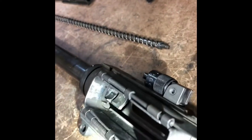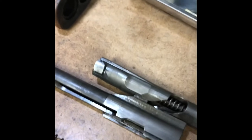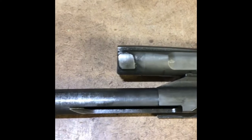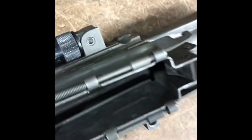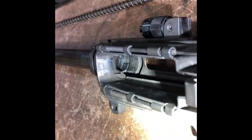Got a flashlight on the inside — there you go. You can see the chamber area and the locking shoulders. The bolt rotates in the locking shoulders, kind of like an M60. The locking shoulders are straight up and down in their normal spring-loaded position. The gun and receiver channel keeps the locking shoulders straight, and the bolt cruises down the channels. Once it gets to the area of the trunnion, it guides in, rotates, and locks for firing.